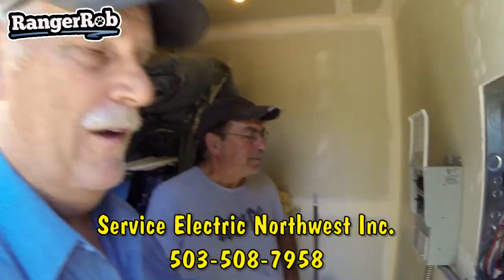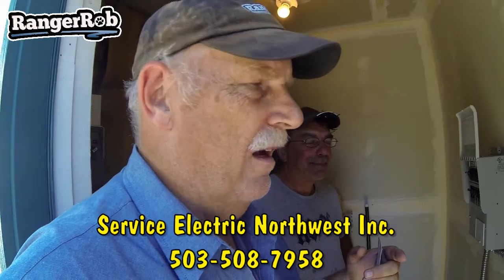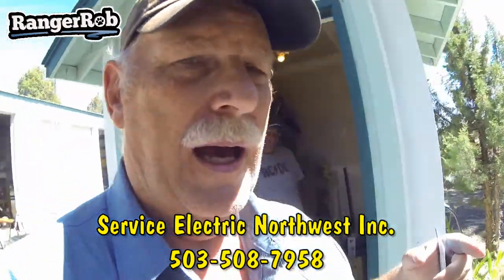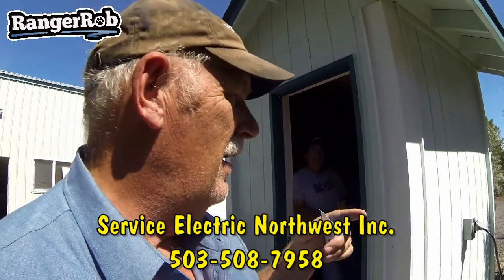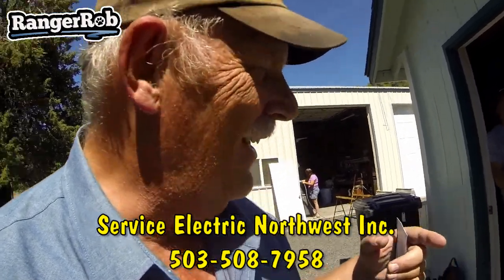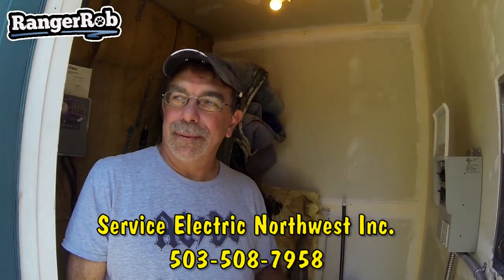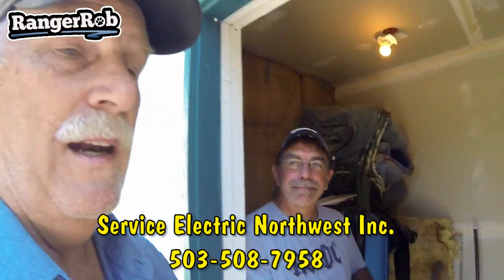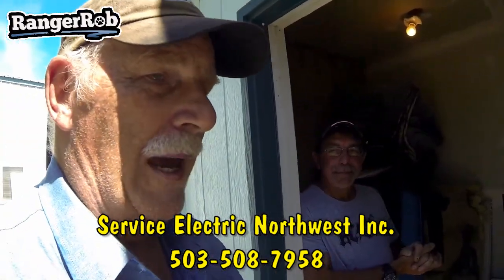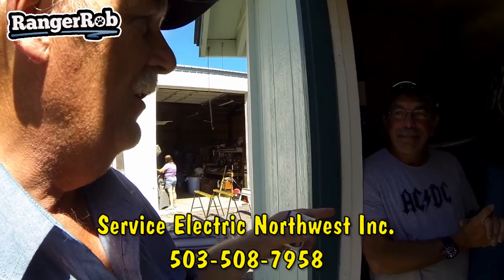In generator mode, these circuit breakers protect the load and the wiring, and in normal mode the normal circuit breakers protect the wiring. Sean was very diligent — he actually came over the same day, looked at everything, and put this in the same day. Where does that ever happen in Central Oregon? There's also an outlet right here — it's a 240 volt 30 amp four-wire twist lock receptacle, which comes with this particular system, and it happened to be exactly the right plug for my generator. No special adapters needed — it was plug and play.